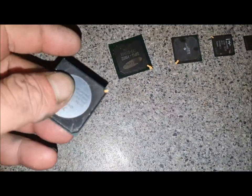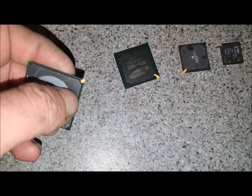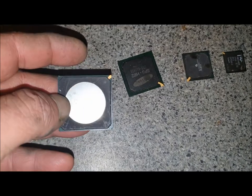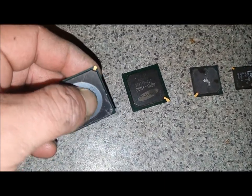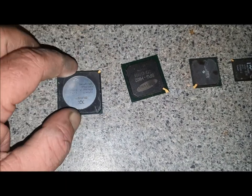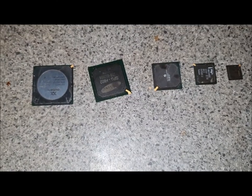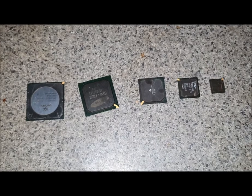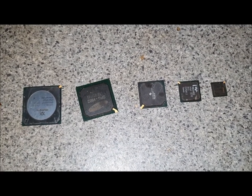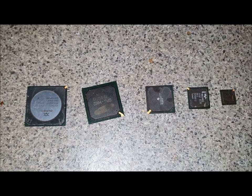And then you've got things like this — this disc on top is actually copper. After taking the fiber away from the ceramic I've tried breaking it in half to separate the copper before roasting them, but it's just too hard. So I process them all the same and pick the copper out later. So we might not get 10 grams of gold per kilo simply because they're not all big, they're not all the same make, and they're not all old.